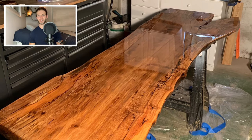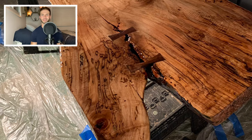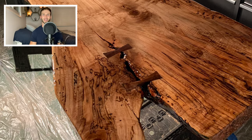After about four to six hours, or once the surface of the epoxy becomes tacky, go ahead and inspect the top layer. If everything looks good with just one coat, you're good to go and can put on your legs. If there are still areas that look uneven or there are some divots, simply apply a second coat of epoxy the exact same way as before.